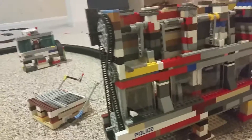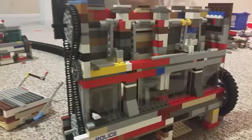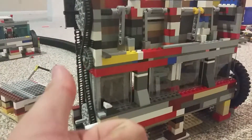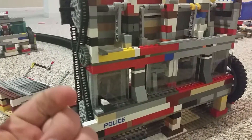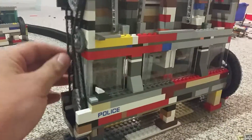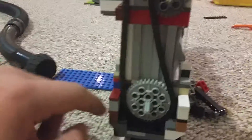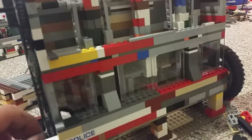Impressive, right? Maybe not so much for you, but it is for me. Like I mentioned in my previous video, all engines claimed to be overhead cam four-cylinders don't show visual proof — they just don't show it. Either that or they're overhead valve, which is a little different — the cam is off to the side, usually gear driven, and then up and over. My favorite four-cylinder that kind of inspired me to do this is that way.